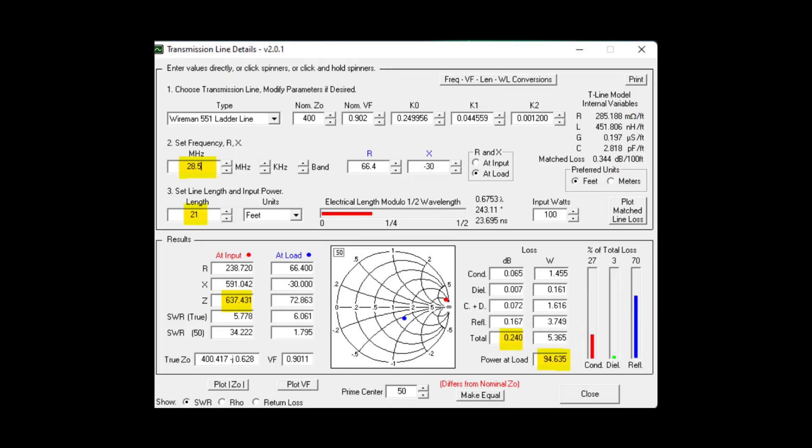When setting up a vertical antenna we're trying to get that low angle of radiation to work some DX — great if you're by the sea. Even just two meters off the ground, a half-wave as this is on 10 meters will do pretty well. In terms of feed line loss, using 450 ohm ladder line, on the bottom right-hand side you can see an overall loss of 0.2 dB with 21 feet — about 6.4 meters — of ladder line.